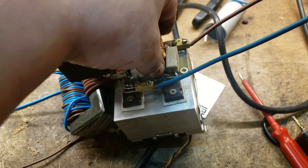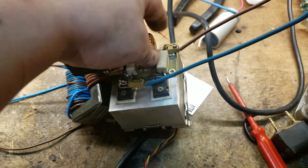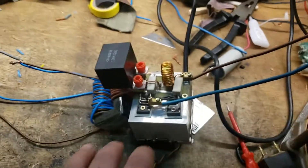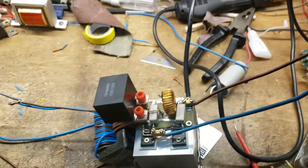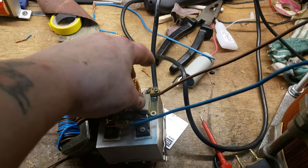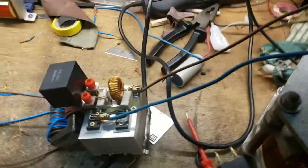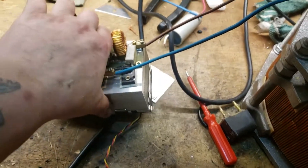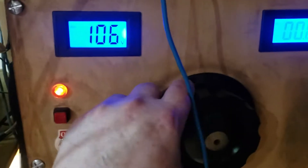There's a little bit of heat in this inductor - I expected that. This is the weak link in this circuit, but we can easily sort that out. I think if I build another one to actually run the transformer I'll use at least four FETs and a considerably bigger inductor - same 100 microhenrys but with a lot thicker wire. This is obviously a constant current source. Well, results - I think we can put a bit more input power, so we'll go back to the Variac, dial her up a little, and fire her back up.